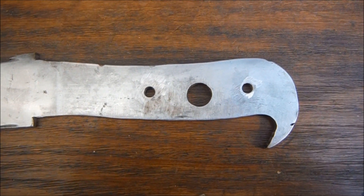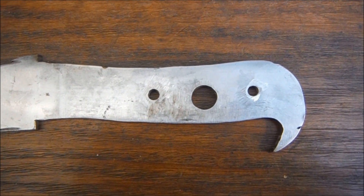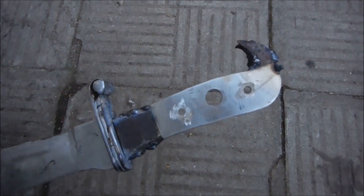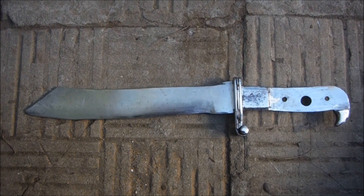For welding the guard in place I've just drilled two five millimeter holes in the tang to accept the pins which will hold on the side scales. Having tacked the guard in place I've been able to go ahead and weld on the two halves of the bolster and the two halves of the eagle's beak. Here it is after a bit of polishing.